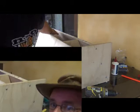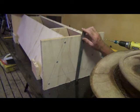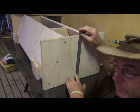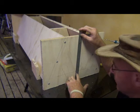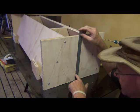The next step is organising where the legs are going to go. I've measured up 70mm but I'm going to bring it down to 50mm — just a 2cm difference, which gives the roof a little more clearance when it goes on, because the legs actually support the roof and keep it a bit off the top bars. I'll maintain the angle that I've marked.